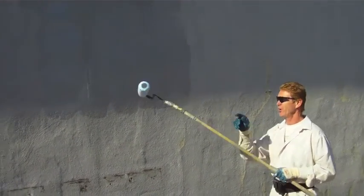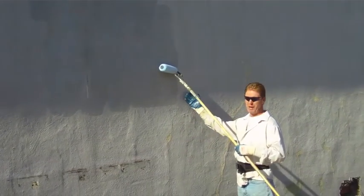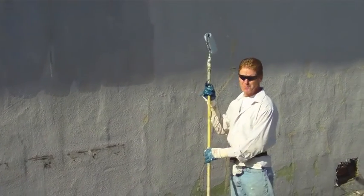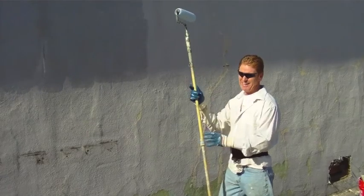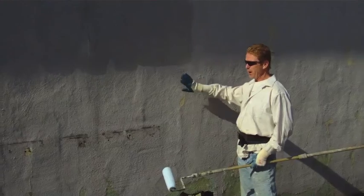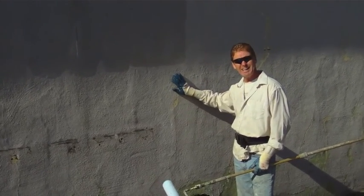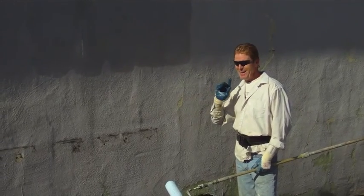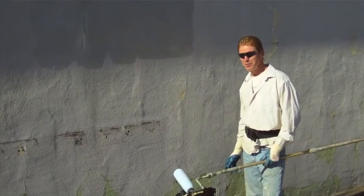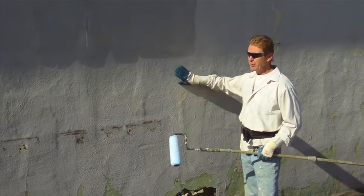Say I started over there and I'm working my way here. Now, if I miss a spot, I can see there's no blue there, so that's why I like Weld Crete. They guarantee that if you apply the Weld Crete over a properly washed finish, free of grime, dirt, dust, and anything, your product will adhere. And if it doesn't adhere, all you get is the can of Weld Crete that you paid for. So in other words, this finish has got to be absolutely perfect.